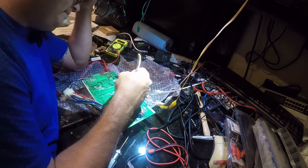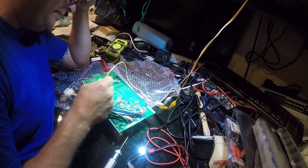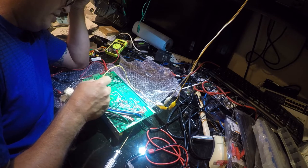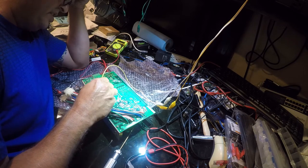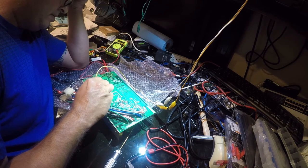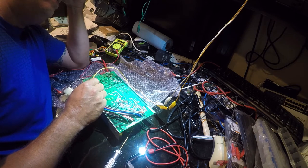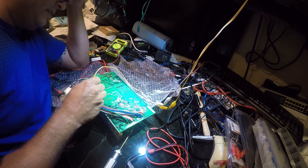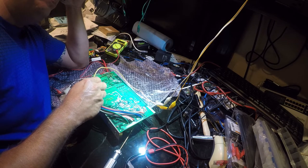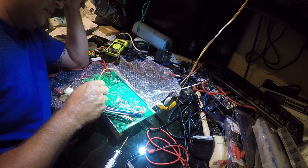That's where we kind of lose things. So I apply 3 volts to this capacitor, I get 3 volts out. If I apply voltage to the output of my MOSFET, which drives this capacitor, I get nothing. Nothing. So this is suspicious because the output of this pulls 0.23 amps and it drains it. It's, I mean, 2 volts here, but it's killing my power supply.